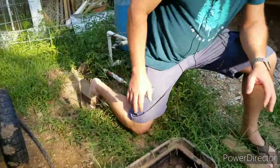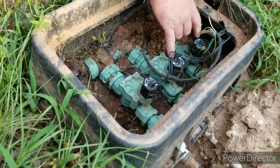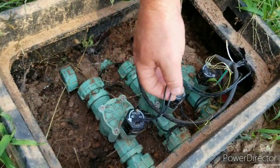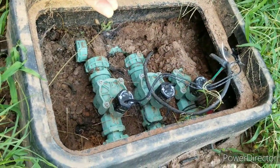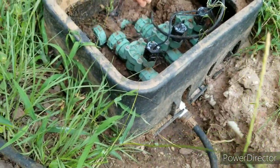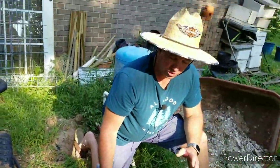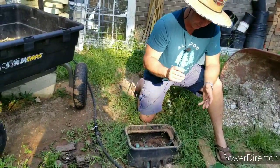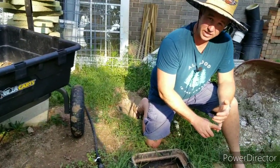What we have here is our well system — our well pump right out of the ground. I have two of these valves set up to irrigate our pecan orchard; this third valve I wasn't using. I have wires that go back into our controller in the shop and it controls this valve. We use this valve to cycle every 10 minutes, causing that sprayer to spray for 10 seconds long. So the final components are: you need the mist controller — one that will do 10 minutes on, 10 seconds long — plus a valve controller and the pipe.